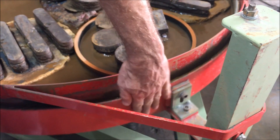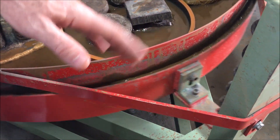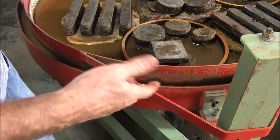On this lap, this plate here is the main tray — it's attached to the spider with brackets. This plate is a two-sided plate, so if you're on a budget and don't want to buy two machines, you can do all your grinding and then take the plate off, flip it over, and do your polish on the other side. We personally recommend getting two laps so you can set one for grind and one for polish without flipping the heavy plate. The other nice thing is that after a while your plate will get some dish to it — flip it over and you've got a whole other side to use. We've been running these in production for several years and the plates are still fine because we use pretty good steel.